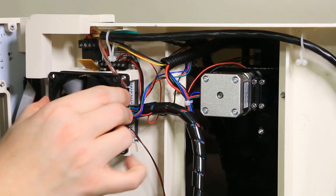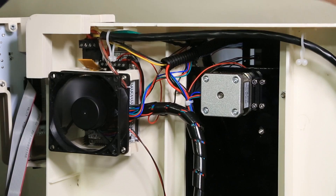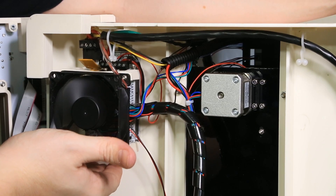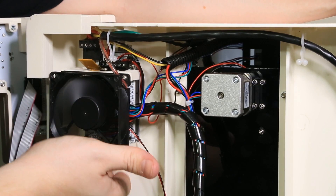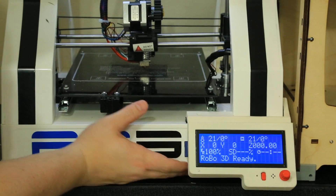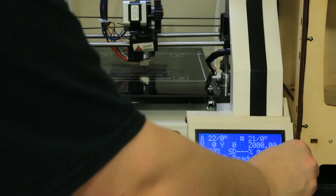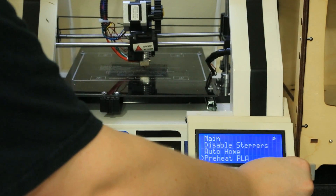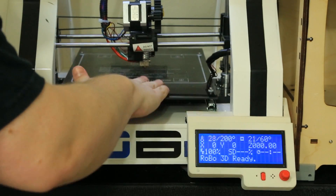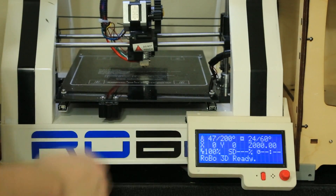The board boots up and we've got a nice vacuum of air with massive airflow coming out the sides — more than I actually expected. It should be a radical improvement. We now have active cooling installed. I can feel a nice breeze under the unit — we've got good airflow. Let's preheat it. Just so you know, every single print failed before 30 minutes — I tried five times. At 30 minutes the heated bed temperature would start to drop, and when it reached about 40 degrees it would fail. Let's see how it holds up now with active cooling.